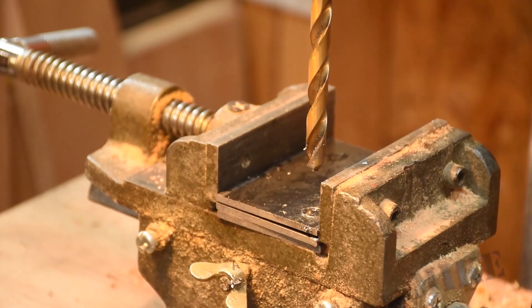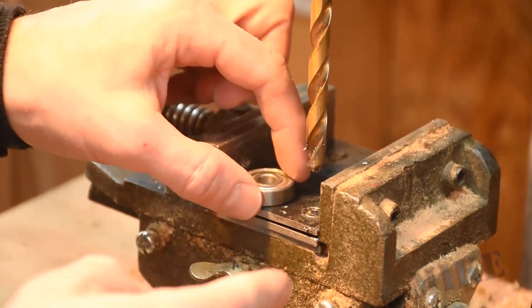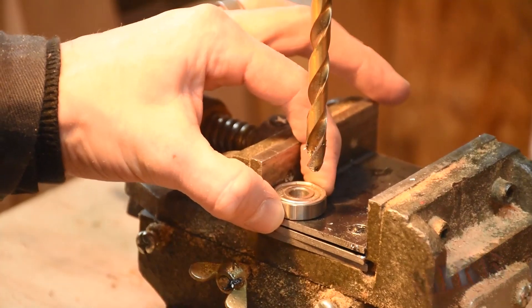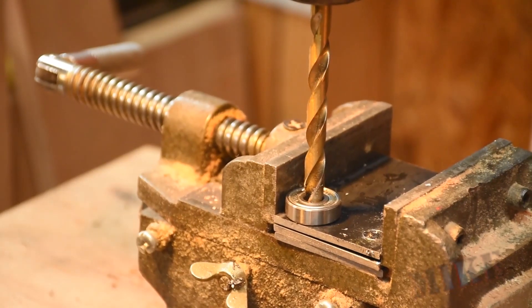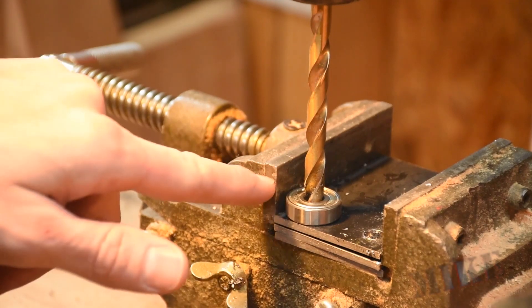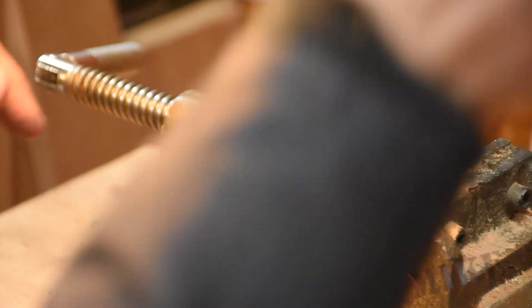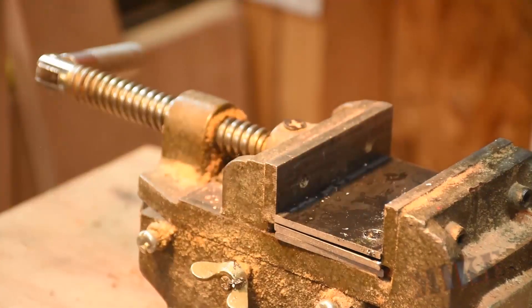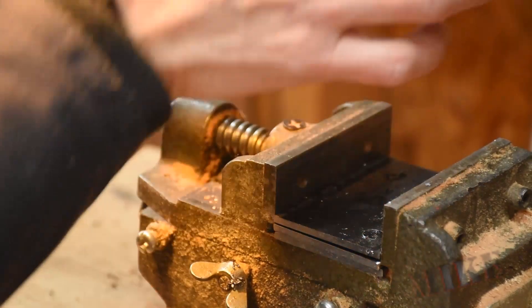Just like I did with my first one, I'm going to lower my bit, keeping it on the same plane, and just move a single axis over. Lower that, lock the spindle down again, and then I can drive my bearing exactly where I want it — just touching this jaw. Back off, try it one more time, come in and approach right there. Unlock my spindle, change to my center drill, and drill right there. Piece of cake positioning.